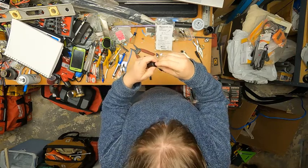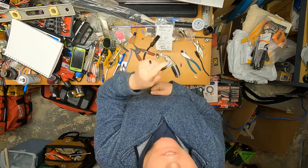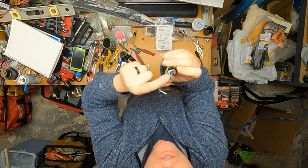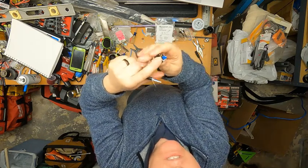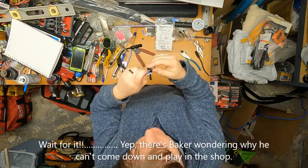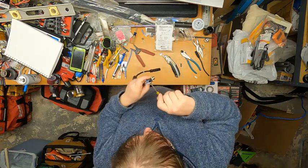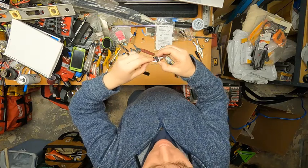This barrel will go back over without any problems. Because this drain wire can be a little bit problematic sometimes, I actually like to start with it. You'll see on the connector — it's actually color-coded. You have white, you have gray which is your shield, you have red for your red cable and black, and then the center conductor is blue for your blue wire. So I'm going to go ahead and put in my shield wire first. And that's where you use a flathead screwdriver and screw that in.